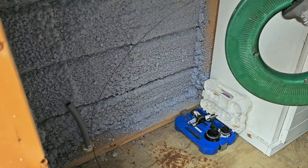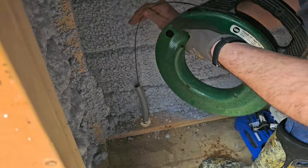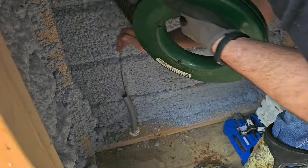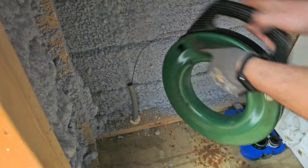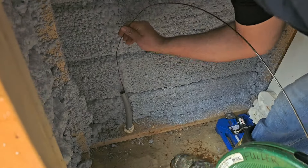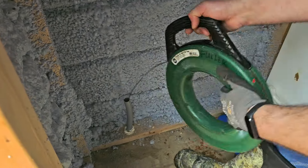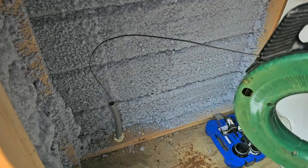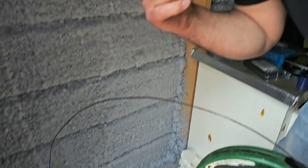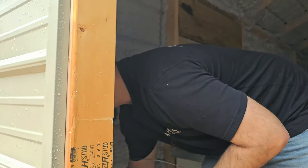We're going to bring some wire out and push it right here into the conduit. You may want to get some gloves. If you're trying to push wire through conduit, there are a couple things you can do. One is you can put some water in the conduit, or some soapy water, or some type of soap. That's a good way to help the wire slide through.